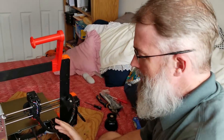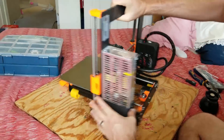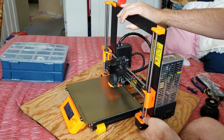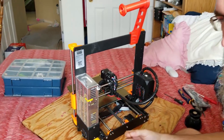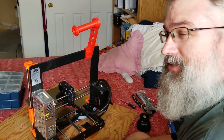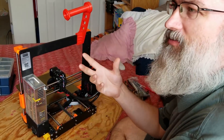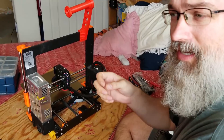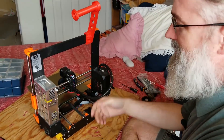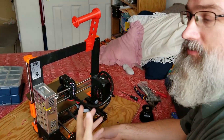It's been a few weeks since my last film, so this will be a little disjoint. I'm still having the same issue. What I actually did before is I took this whole thing apart — the issue is with the fan, which was covered in the first part of the video. I examined the wire and couldn't find any place that was obviously messed up. I even put it under a microscope — I got a new microscope so I was playing with it — and I couldn't find anything, except at the very end there was a little bit that was frayed. So I cut that last bit off, stripped it, and re-soldered it. I still have the same problem, so I think it's in a place where I just can't see.